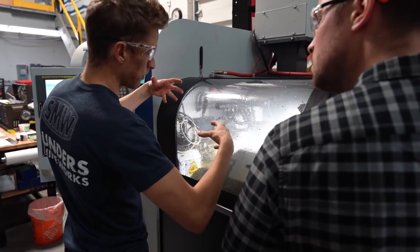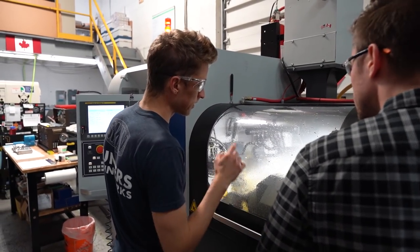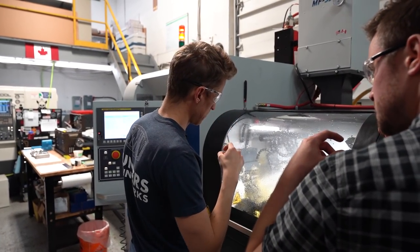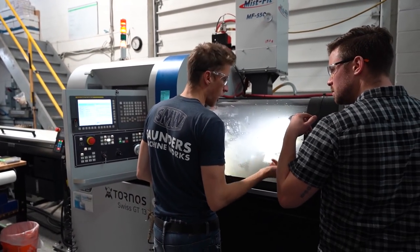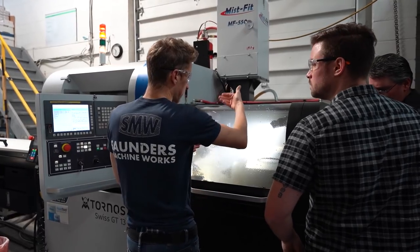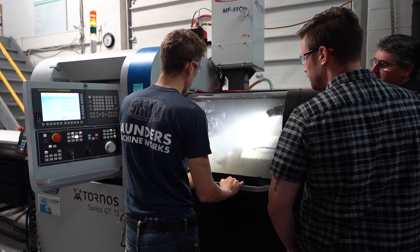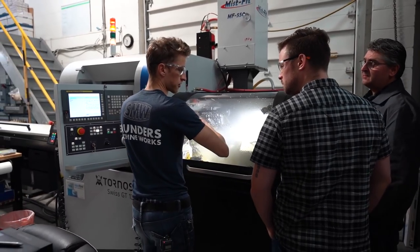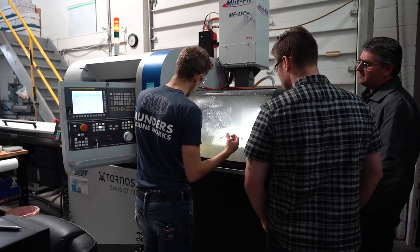Yes, you got machining happening on both sides, which is amazing. And then you have to switch rotation, or your tools are just offset the opposite direction. The tools are offset, so one's right side up, the other one's upside down. That way you're efficient, right? You're always spinning the same way. It takes half a second or whatever to rotate. It's no big deal. We're good. Transfer right now.